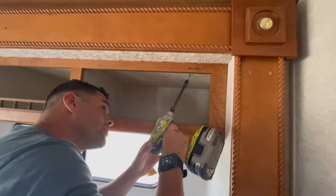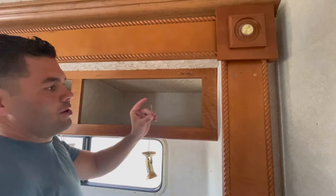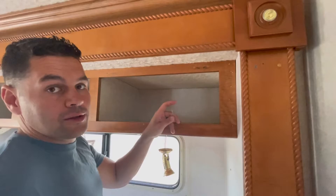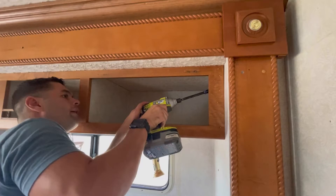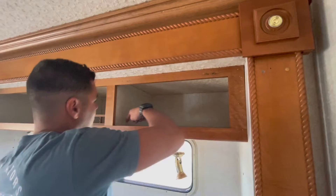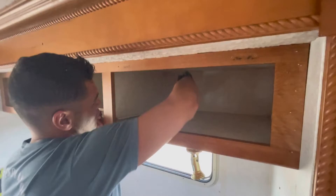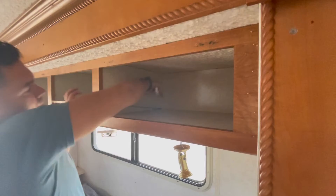The extension is important here. Now you can also use the removed screws as a reference for the size of screws you're going to put back, in case you need to put a shelf or anything like that — so you're not poking outside of your RV. Once you remove all those screws, you have these trim pieces. You can scoop them from underneath and pull them up. They've been nailed down.